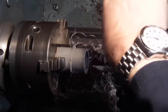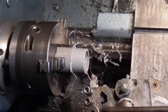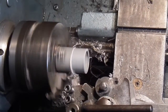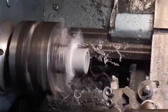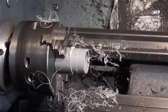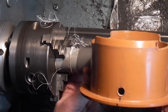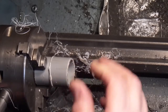I've put a piece of plastic pipe — this is just ordinary waste pipe from your kitchen sink — and I'm turning it down a bit to fit the other end of the pipe on my guard. To stop the jaws crushing the pipe I'll put a small round piece of wood inside. It doesn't need to be an exact fit; it's just for the vacuum attachment.